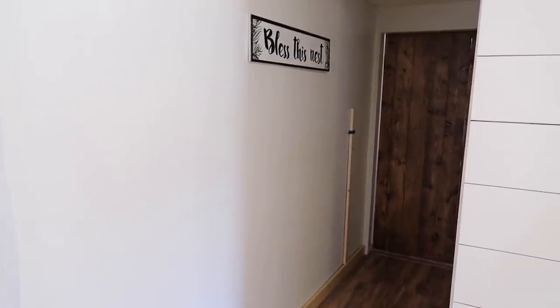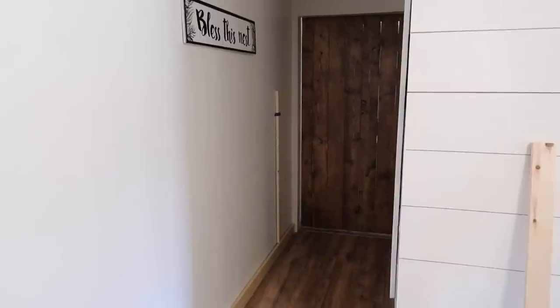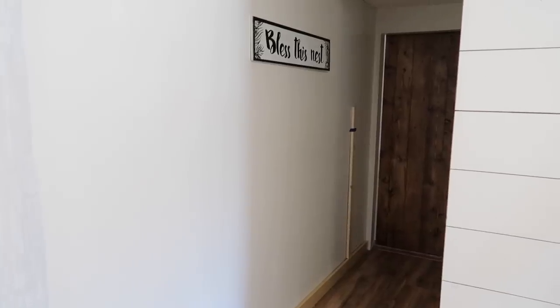This is what the hallway looks like right now. I've laid some one by fours down here for the trim — I don't have any baseboards in this trailer yet, but I'm going to do one by fours and then one by threes that I had cut at Lowe's down through here. Since I do this by myself, what I do is take painter's tape and put it across the boards to line them up and make sure they're all even before I ever nail anything in place. This hallway is dark — I have it brightened up a little on my camera, but I really wish I could find a way to make it brighter. If you have any suggestions, let me know.